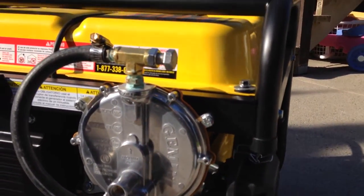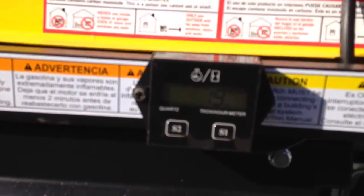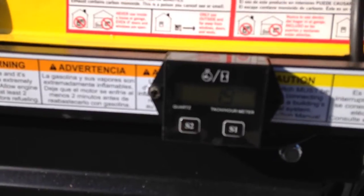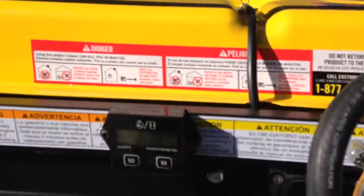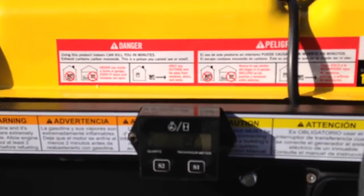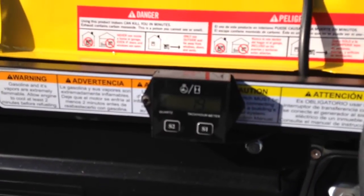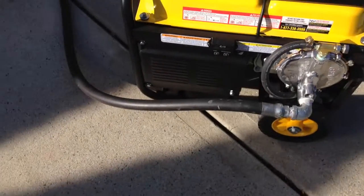I also had to cut part of the frame out, which is no big deal — they give you caps which fit nicely. I also had to get this tachometer hour meter from eBay just so I know how many hours this thing's been running. It will help you adjust the load block so you can look at the RPMs and set them to the optimal level, which is about 3,600 RPM.